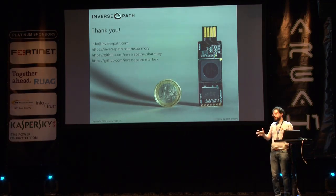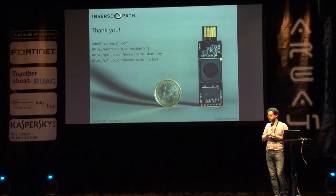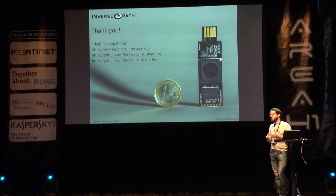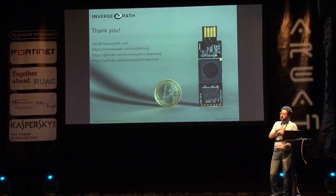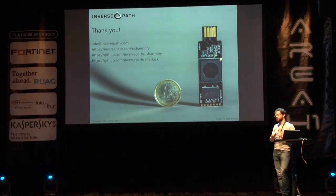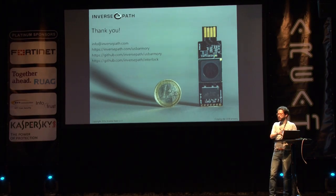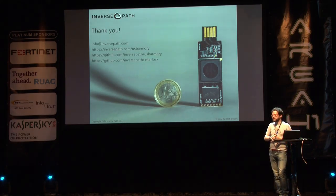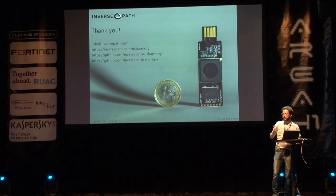We've seen a lot of embedded devices that just have an external component for doing that. They have like a crypto authenticator, which is external. But the problem with that is that you can always intercept the bus. And if you want to secure that communication, then you need to use a secret which is in the code. And some people do secure boot, but they do not encrypt the firmware, and then you can find the secret there. So it's tricky. Interlock intentionally doesn't leverage on this. It only leverages on secure boot, because the use case is that you're going to put your password anyway. So we don't want to waste time having secrets which are not necessary. Thank you. That's a very good question.